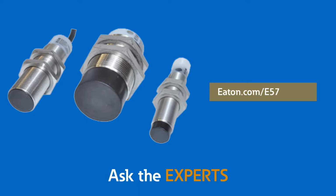Let me find one. So here's an example of the sensor you see on the left, where the cap of the sensor is flush to the tube. That's what's known as a shielded sensor. Those sensors are suited to be mounted directly into a metal surface, flush to the metal surface, and they have a much more narrow field profile, so that type of sensor is more resistant to other metal in the target area.